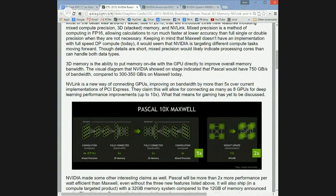And not only that, but here you've got a 150, 160, potentially 250 watt TDP GPU at the bottom, and you're stacking layers of silicon on top of that. Now, silicon is an okay heat transport agent, but each of those memory dies is going to be producing heat of its own, and memory is a little bit more sensitive to heat than other types of logic. At least, is that correct, Alan? Yeah. But man, can you transfer data quickly? Right? Yes, you can in such a setup. So AMD is, of course, going with a 2.5D solution. So they've got a substrate, they've got the GPU, and then they've got the memory stacked around there.